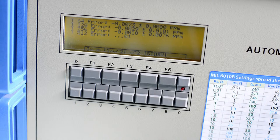There are, of course, all the uncertainty budgets on all the measurements of each lab on the same travel standard, but there is also a calculation of the agreement between the labs, and there are certain limits. If the agreement is outside the expected limits, then that lab either had some issues with their methods of measurement, or maybe they had equipment issues, or the equipment they used was not good enough. So that analysis is also done, but I'm not familiar with the Z score. What's the Z score? At least I don't remember offhand seeing the Z score term in the papers and reports.